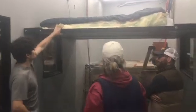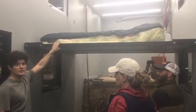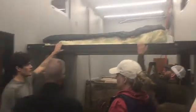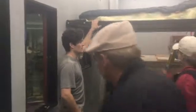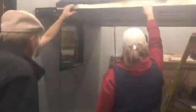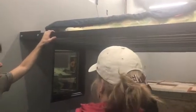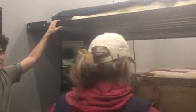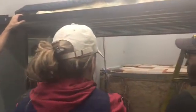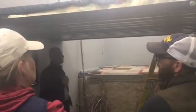And I'm not aware of any tiny house that has a loft that's this thin either. Typically you're seeing framing with 2x6s, and this is 1.5 inches actually, using bead decking. It's galvanized steel. So it's not finished yet. It's just kind of proof of concept for me at this point. Is that steel decking? It is. The kind you use for a concrete pour on a beam? Exactly.